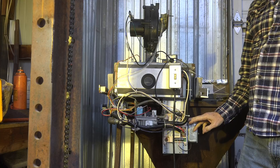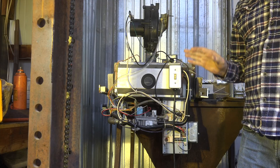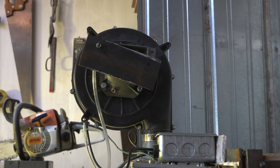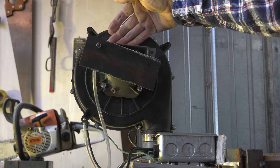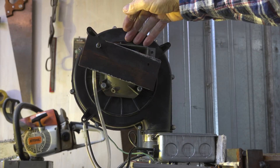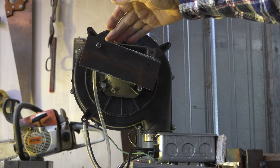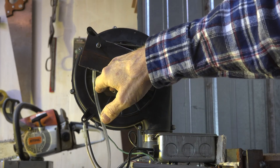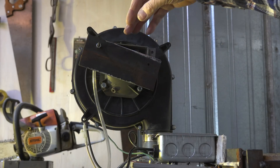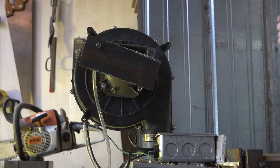Here is the integrated furnace control, the gas valve, and we've got a pressure switch over there. All those things that were safeties on this before, I put on here. Now here we're looking at the inducer from the side. This inducer was placed so that this side of it went up to the front panel, where it sucked in off of the heat exchanger — there's a fitting there, that's this piece right here. I took that fitting off of the heat exchanger and mounted it here; you have to drill a couple of holes or self-tap so that it will mount on there. And then I've made an air shutter here, and you adjust that air shutter to get the proper flame and temperature that you want.